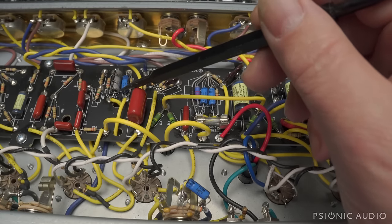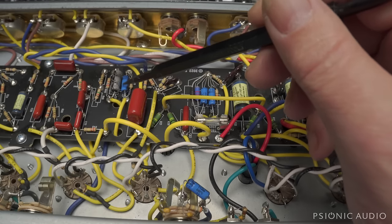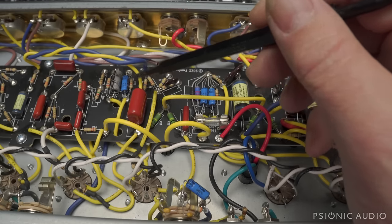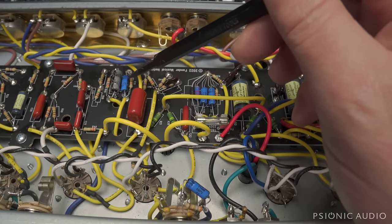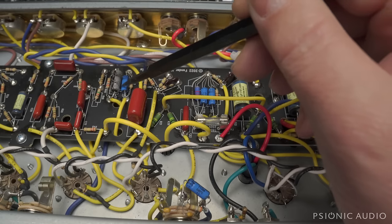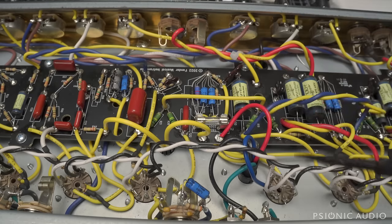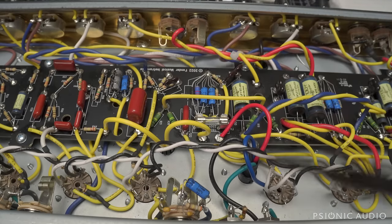And if there's a problem with this cap, if it's not fully bypassing the stage, then you will get feedback within that stage, because that is mixing the wet and dry and then going to the next gain stage. So we'll be changing this cap out to get rid of that feedback in the reverb. That's probably the culprit right there, 9 times out of 10 at least.